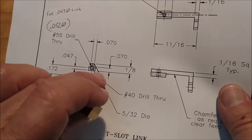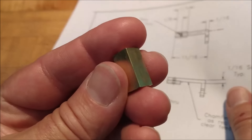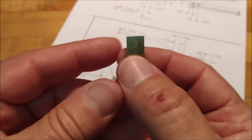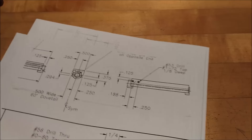For the initial operation I'm going to do the end detail, pop that hole in, all banking from the outside. I know that this is reliable material — dimensionally I know what it looks like. I'm going to stand it up in a secondary vise to do the holes on either end.